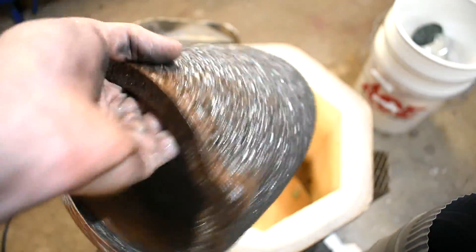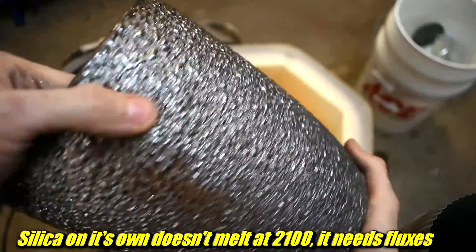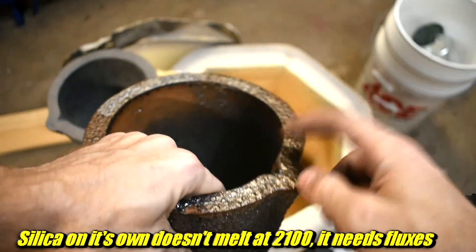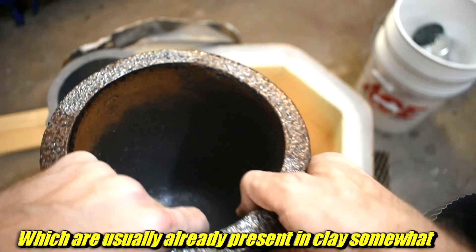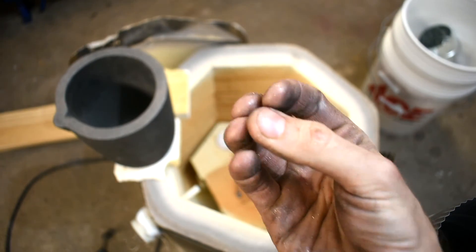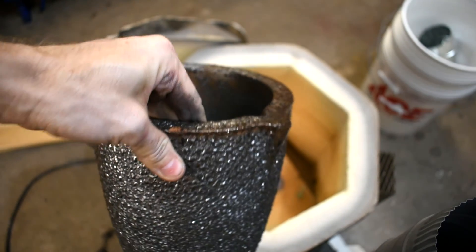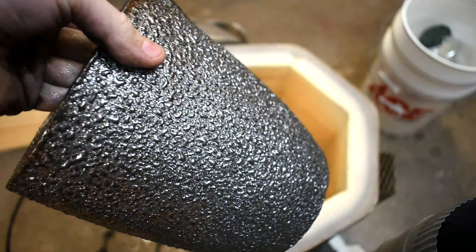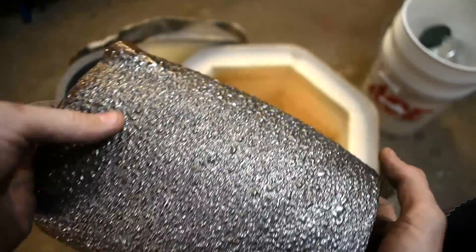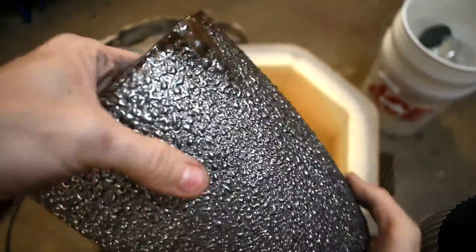Heated it up, and it looks quite different. Close up, you can see it looks like little balls of glass came out of there. That's because one of the major components of clay is silica, which is the same thing as glass, and firing it melts the silica. That does a couple of things — it makes the clay less porous, and it takes all those sintered particles and melts them so they flow together into one piece. So basically you're turning sintered material into something more like cast material. Instead of the bits being stuck together, they melt together and form one piece. It makes it stronger.